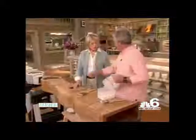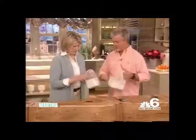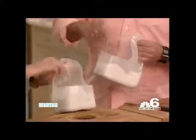You have to mix it. It's a powder base. It's not open the lid, dip in, and paint. I love how you cut these out. So you just cut these out with a little scissor? Take an old tea container, take a razor blade, a razor knife, and cut it out. Milk paint settles constantly when you're using it, so you constantly have to stir it. And then after you get done stirring, put your fork back in. Okay, you're done. Wow. Fantastic.